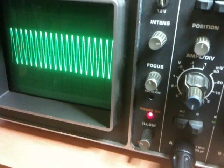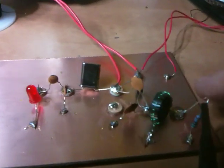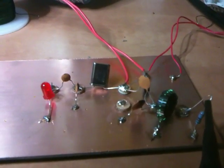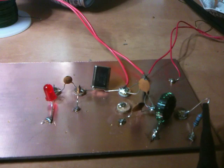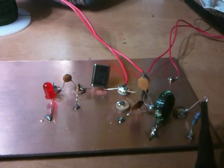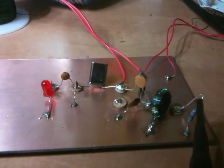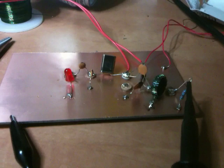About a volt peak to peak — one volt squared divided by the resistance 50 comes out to 20 milliwatts. If I touch the transistor here it's not even getting warm, and this resistor can dissipate about 250 milliwatts, so that should not be a big deal. The power output is also about 20 milliwatts. Hans got his to run off 1.86 volts at 65% efficiency.